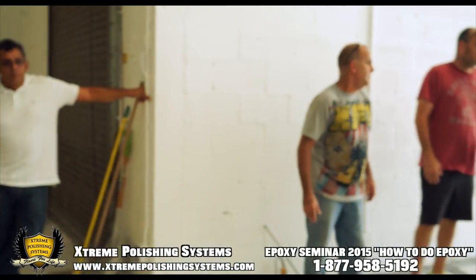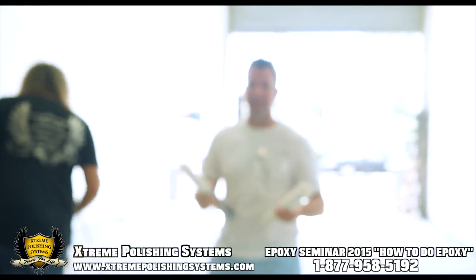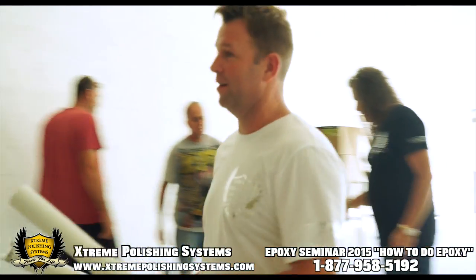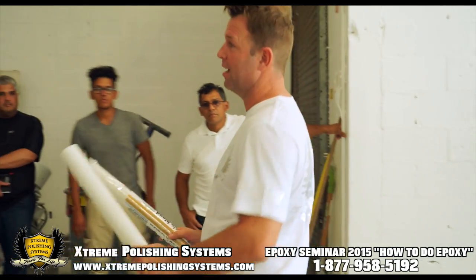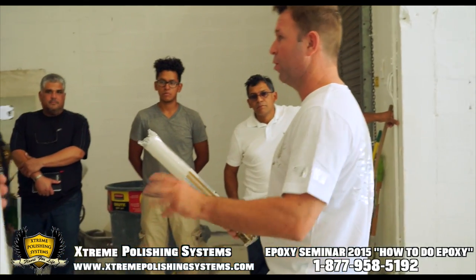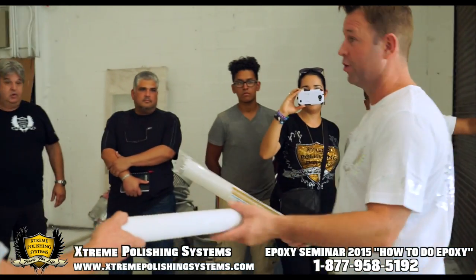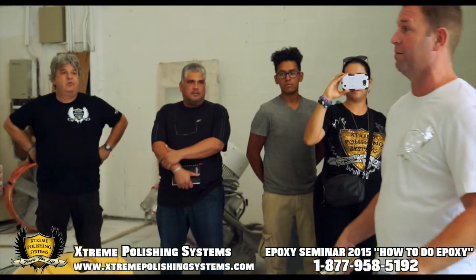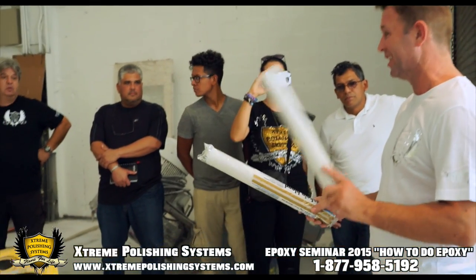Your rollers, okay? The importance of the rollers: lint free. Rollers will always put lint in a floor. If you're not using a chip floor or a quartz, if you're doing a solid color and you start getting roller lint in there, your customer won't pay you. You have to have a smooth floor, so you always have to have a lint free roller.